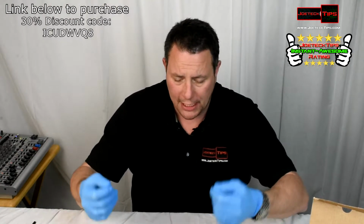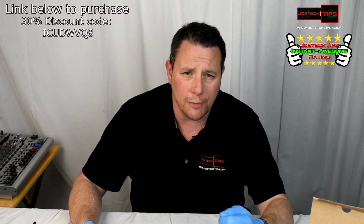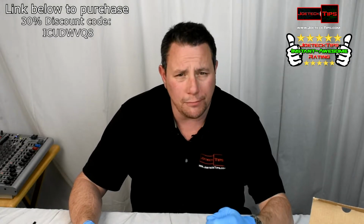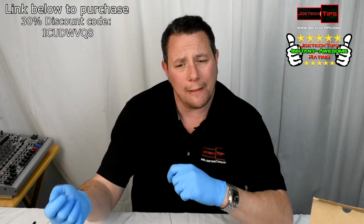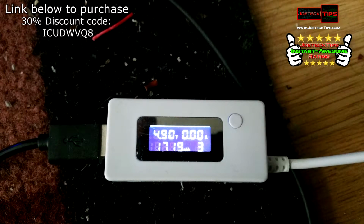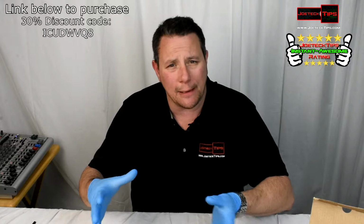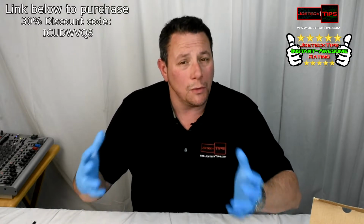I actually wanted to see if the battery pack is actually 3600 milliamps. So I have a special piece of hardware that can monitor how many milliamps are being put into the battery and how much current draw the device uses when it's always on. It drew about 1 amp, 0.99 of an amp, and I was able to put in about 1700 milliamps into the battery. So that means about 1800 milliamps came shipped to me, which is cool.